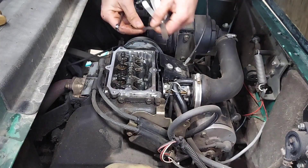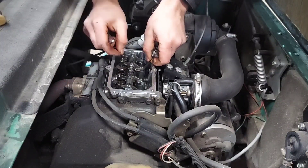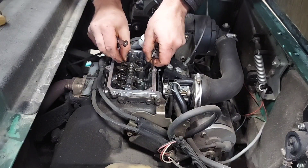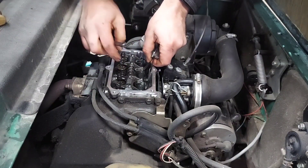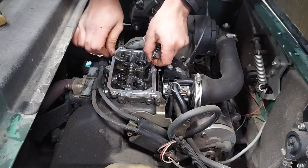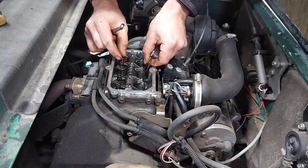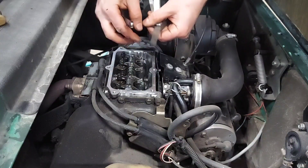All you have to do is after you back off your jam nut, put your four thousandths in there, and then you turn that little square piece just slightly — barely anything. Back off the nut barely anything, then tighten the nut back by hand. You should be able to slide the four thousandths in there and then slowly snug that down. If you do it like that it'll slightly move that square head so it fits nice and snug.